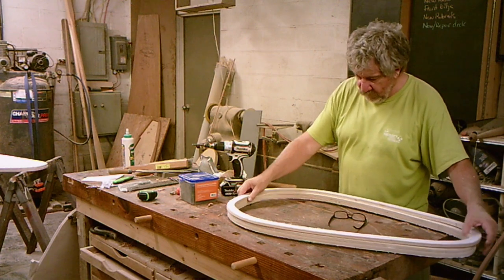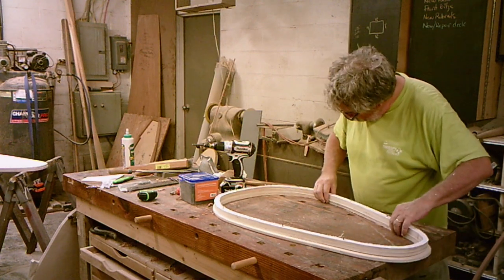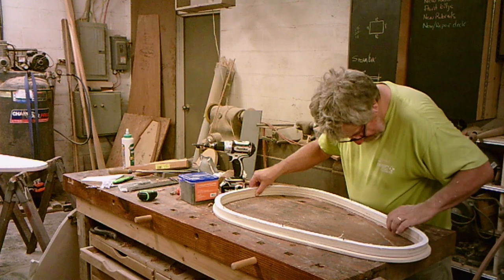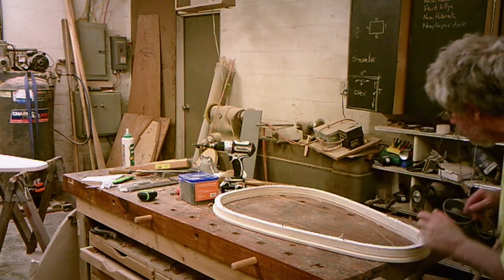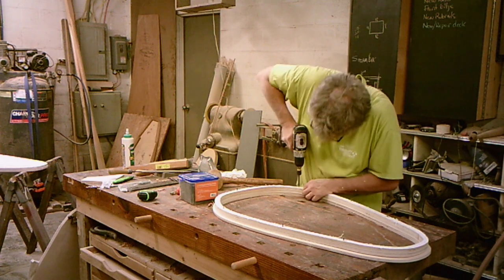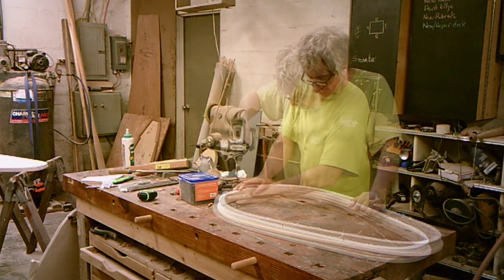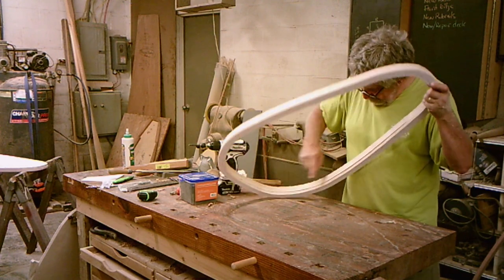I'm going to take and put these rings together. There's just a little balancing act here of finding the alignment — you just have to keep messing with it because they never line up perfectly. Go through here and find your best alignment. It's a compromise, but you find what looks the best. See if it looks consistent around the edges. Then drive your screws all the way in. Get a second one in. Now we're going to go use my favorite tool in the shop, the oscillating spindle sander, and go back and clean up this inside and make these edges match up.